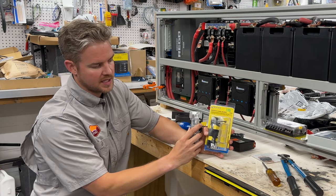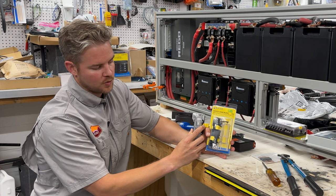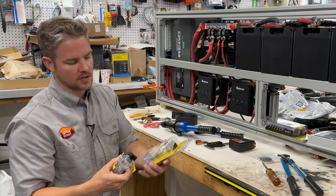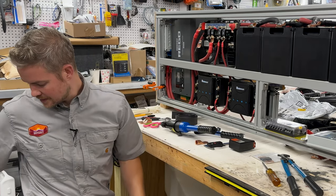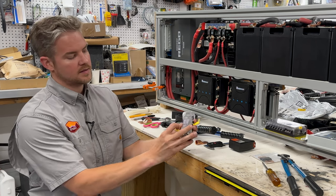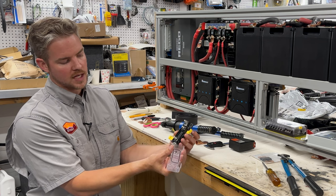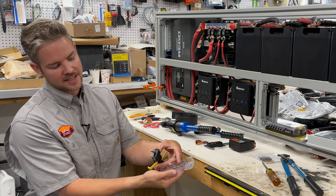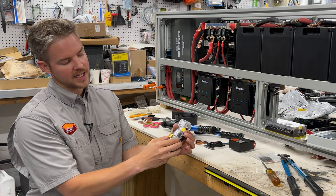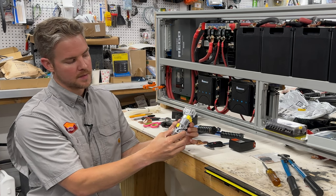And so this will be the point that is protecting the power cable of the 12 volt line going from the engine battery to the DC to DC charge controller. What's nice about these Blue Sea Systems safety blocks is they're actually designated for the engine bay of a boat, but they have a gasket here. It snaps over there. The wires are protected. And then these yellow clips are really nice because it's a very satisfying click to shut this top.